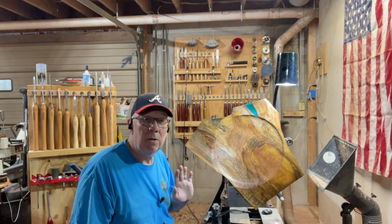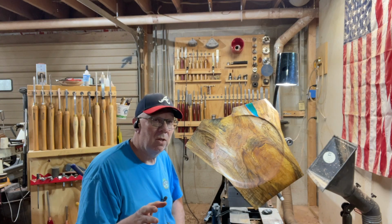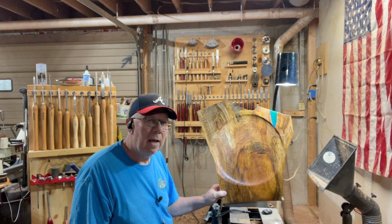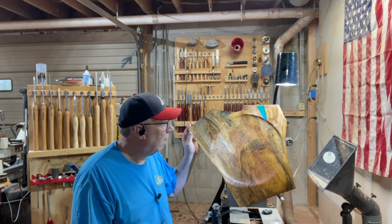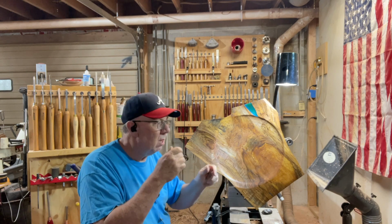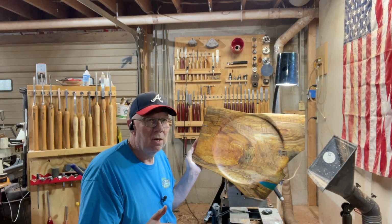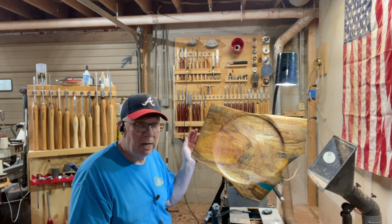When it was rotating, it was pretty much like a propeller. I mean, it was off center, obviously, and the best I could probably get was about 400 RPMs, maybe a little bit more than that, before I had too much oscillation and hopping. And when I was cutting, I got a lot of the, you know, which was expected when you're cutting here and such. Well, that's new to me. I don't do it a whole lot, so that was a challenge.